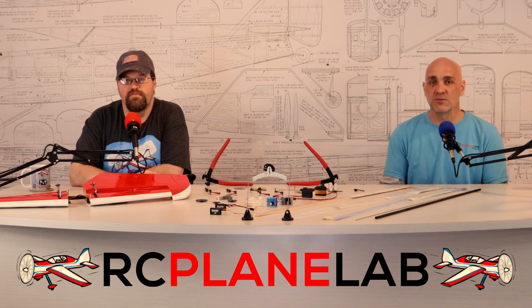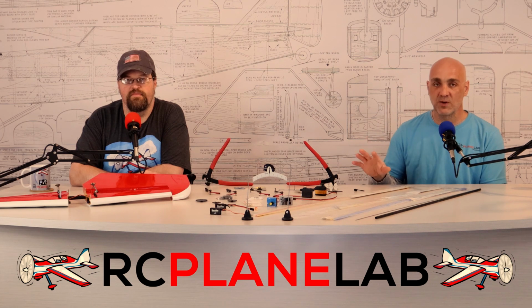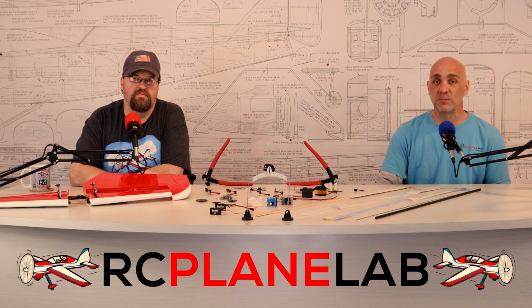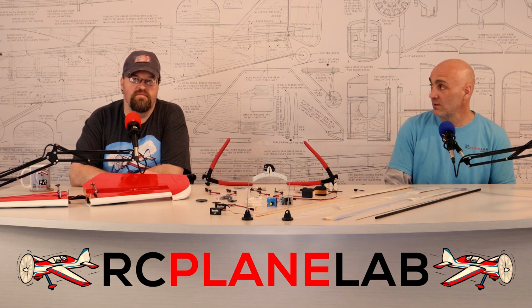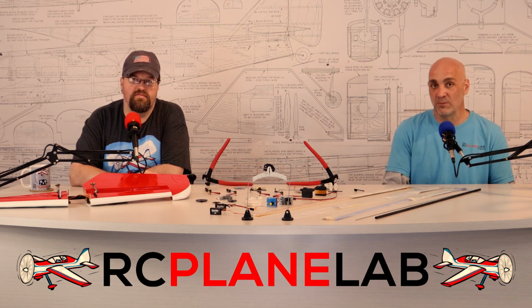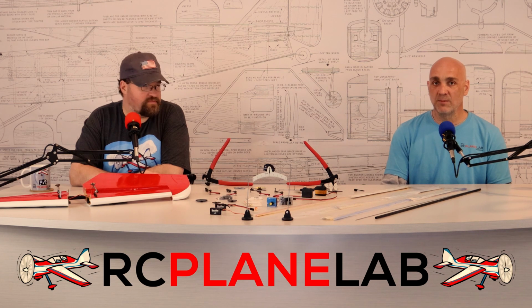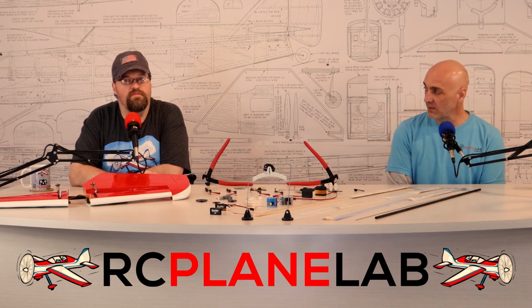And the reason for that, again, is just resolution. I want to get as much resolution out of my servo as I paid for. And if I go 1-to-1, I'm leaving that on the table because I've either got too much travel that I don't need, and therefore I'm using up steps in the resolution that I don't need, or it's setting up some potential for slop or something like that. So I try to avoid 1-to-1.